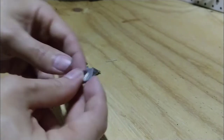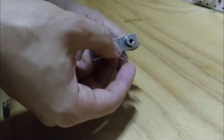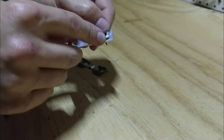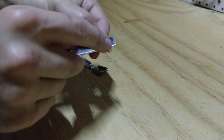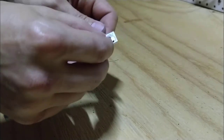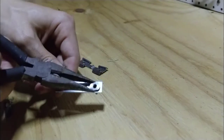If you have a screw on the other side that you're trying to screw into here, it can keep on spinning as you turn it, making it really hard to get in. You have to apply some pressure on the back end as you're doing it. So what I would suggest is if you use something like this, squirt a few shots of super glue or putty to keep this locked into place. Understand that it's not going to be 100% — it may eventually break free. And if you ever need to adjust this, you might have to pull out some of the foam to get at it and hold on to it with pliers to make sure it doesn't spin. As long as you hold on to it on both sides, you can screw into the other side no problem.